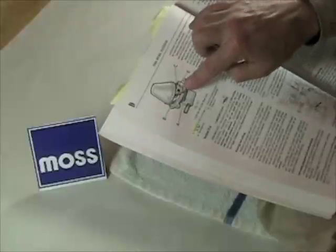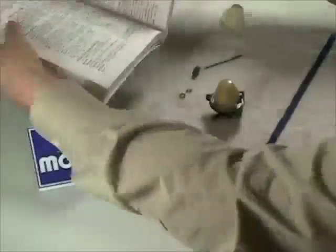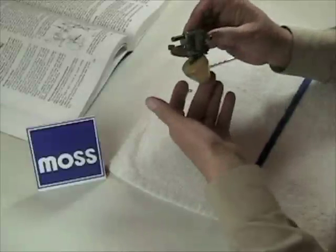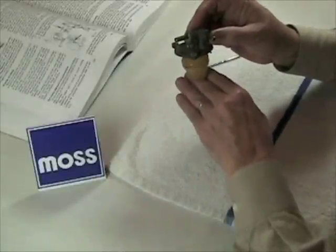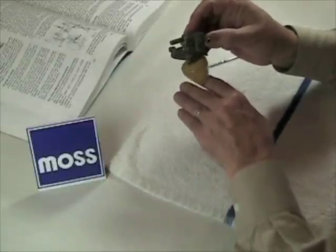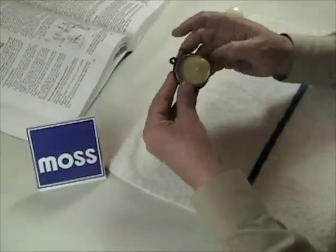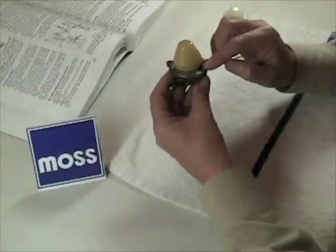You've probably noticed in this illustration the cover for the float bowl is upside down. Well, if we take the cover that we've got here, when it's in the car it sits like this. As the fuel level comes up it pushes it and closes it, and when the fuel goes down — that's how she operates, up and down like that. I can't adjust it when it's in the car, so when we take it outside the car to work on it, we turn it upside down and gravity holds it just the way that the fuel would hold it.